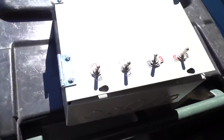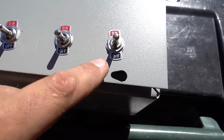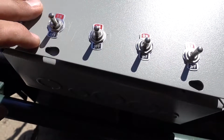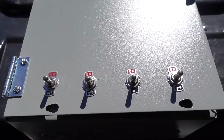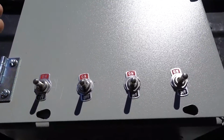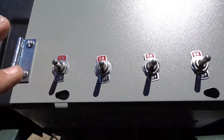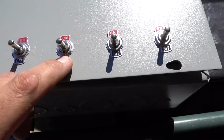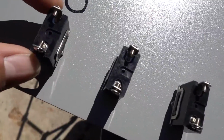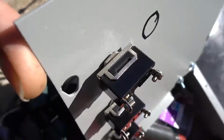And so I measured it out and put on the little toggle switches here. I'm not happy at all with these switches actually. I'm kind of following a website, a how-to of how someone actually built it. They built it out of sheet metal and wall studs and whatnot. I'm just using an old oven, but for the control panel I ordered all the parts that they used, and these were on them. And for being 120 volt switches at 25 amps, yeah, right there. I'm sorry, 15 amps. Says right there.